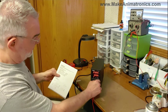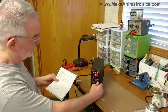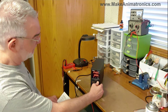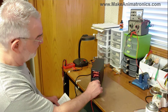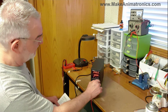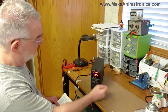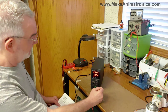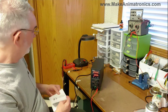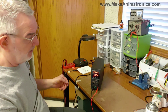Let's go up to 5.5 volts for demonstration purposes. I'll push the button in to select the digit I want, go to 0.5, then push again to get to the left side of the decimal place. There we go — 5.5 volts at one amp. Let's put a load on here and see if it holds up.